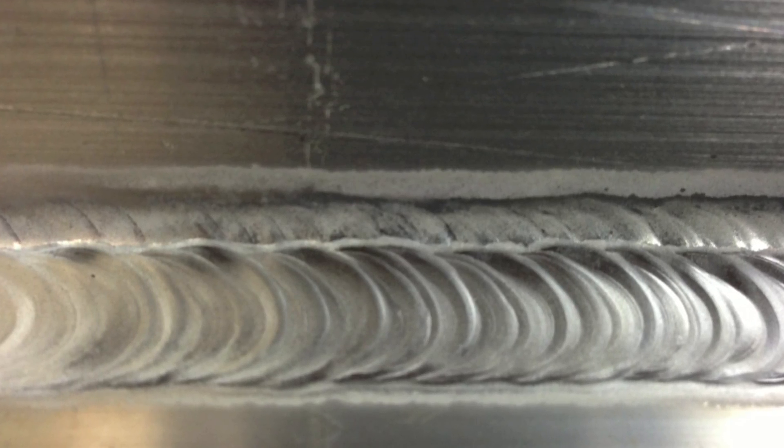For the second pass I operated on the lower toe, using that as the centerline for the next weld. The first pass goes into the corner, the second pass is on the lower edge. Keep that full, and then you're going to see a picture of the second weld — it tied in real well.